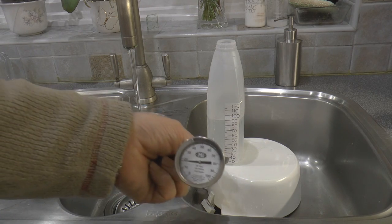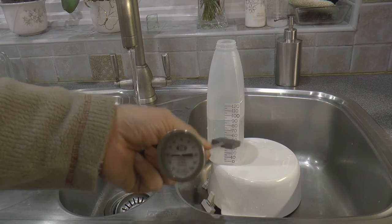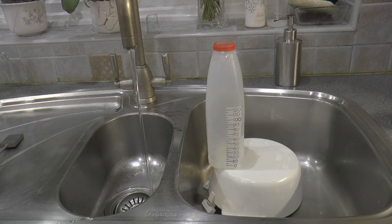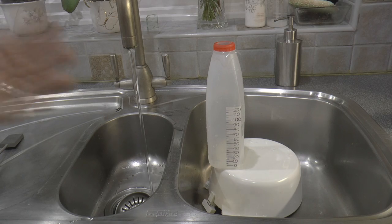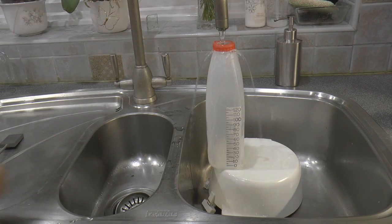The first question is, is this a calorimeter? Well, not really. You can't use standard calorimetry rules to work this thing out. Why not? A couple of things I want you to remember. First of all, when we looked at reflectance, remember we looked at aluminium, natural aluminium, and it had a very, very high reflectance. So if we use an aluminium block as a calorimeter or as a means of absorbing heat energy, the first thing that's going to happen is this. It's not going to absorb it because most of it's going to be reflected off.